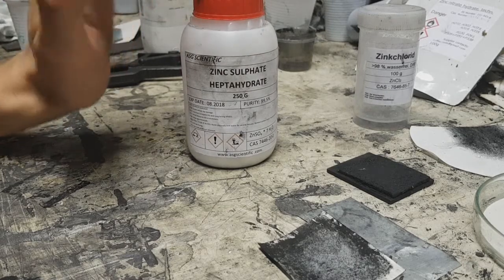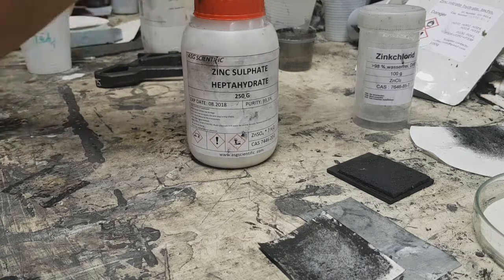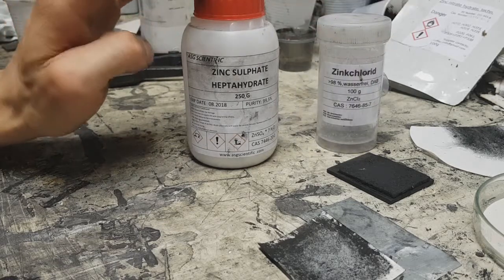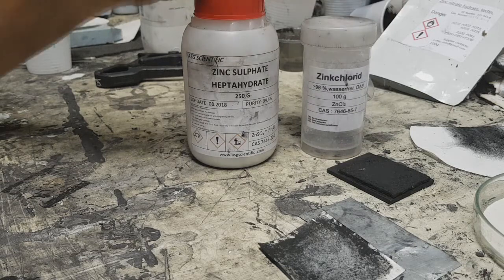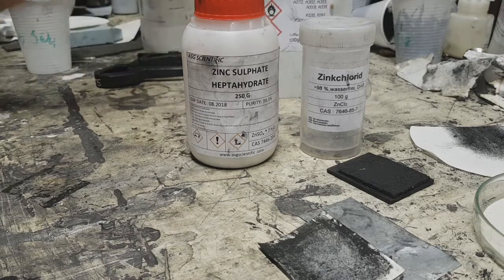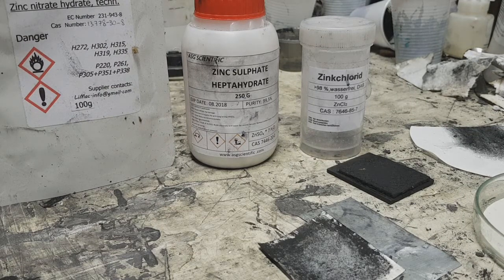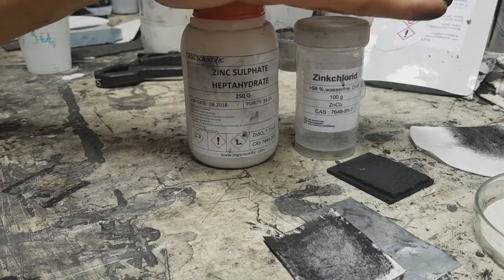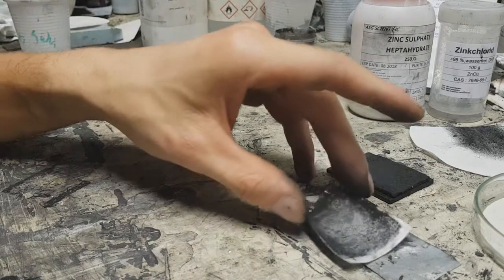You can try only water with zinc sulfate and see what you get. In my case, using only zinc sulfate in water was not really good, but with the combination of zinc chloride I got really really good results. I add one teaspoon of zinc sulfate to the water and less than half a teaspoon of zinc chloride. You can also try combining zinc nitrate and zinc sulfate — it's all about experimentation.